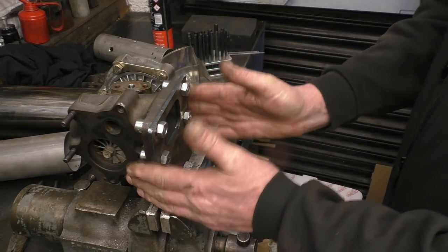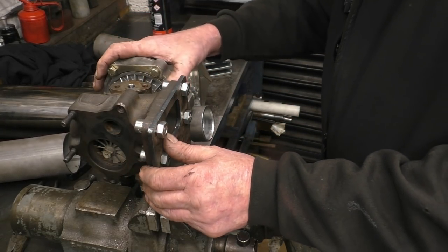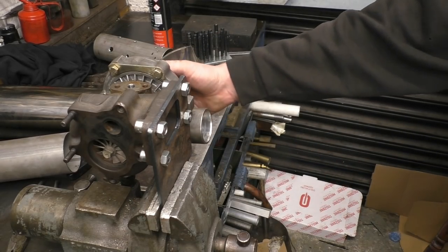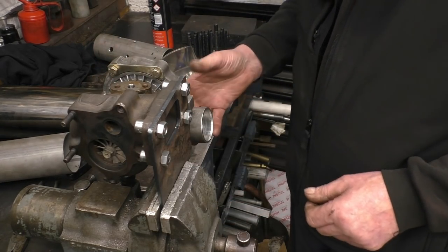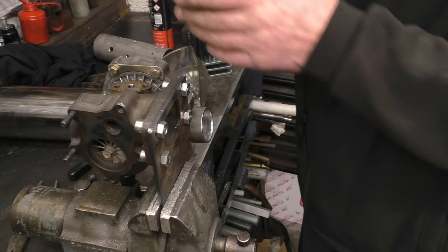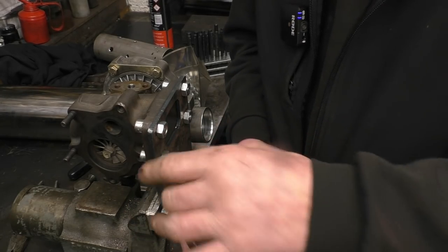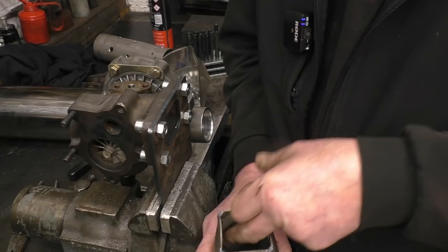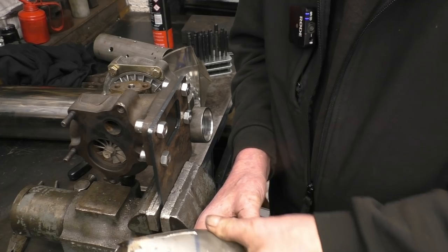Making a stand to hold it all could be the next thing, and then I can sort out oil pressures and oil pumps - make sure I've got plenty. I think I've got a pump that'll pump enough oil. There's certainly plenty to do - plenty of pipework to play with, plenty of welding to do. I'm not 100% happy with this pipe fit; I've got plenty of pipe to play with. I'm going to go and weld it and see what it welds like - I'll probably put a little copper backing piece in there just to try and keep some argon shielding gas in there. We'll give it a try.